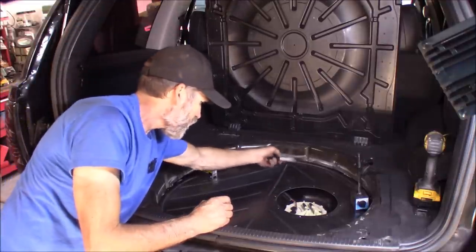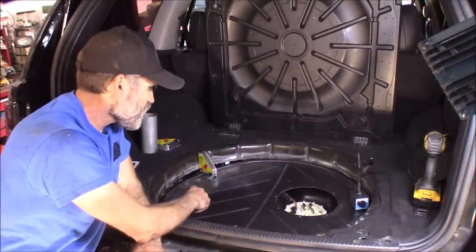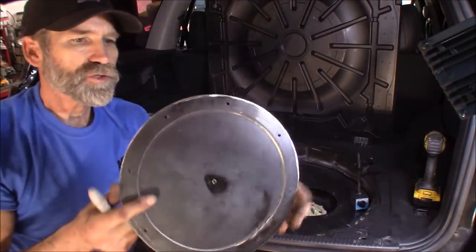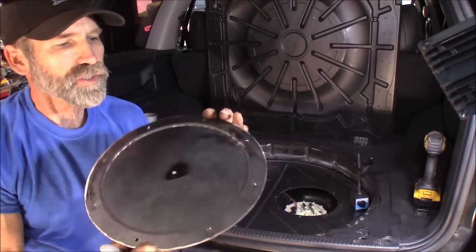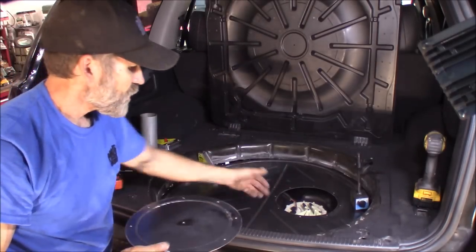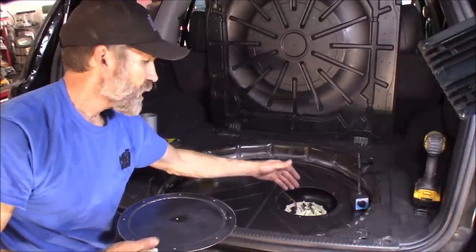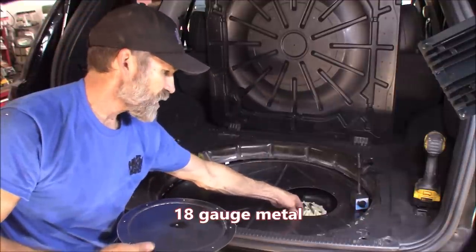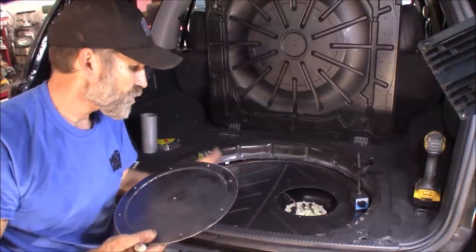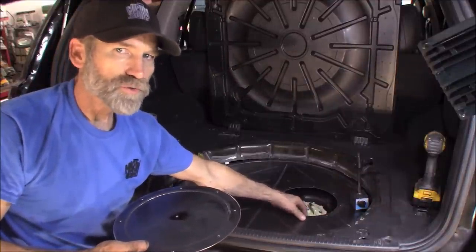Keep that in mind if you follow this video. I'm going to make my mark here now, drop the tank, get this piece of metal held up into place, and start tacking it. I also went ahead and drilled the holes in this cover - eight screw holes equally spaced apart - and tapped them in the sheet metal to 10-32. Being that it's only 18 gauge metal, I think those fine thread screws bite plenty good, but I may back them up with some nuts and tack weld those into place.